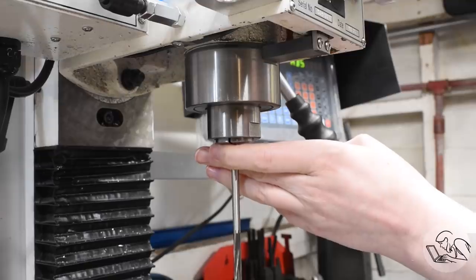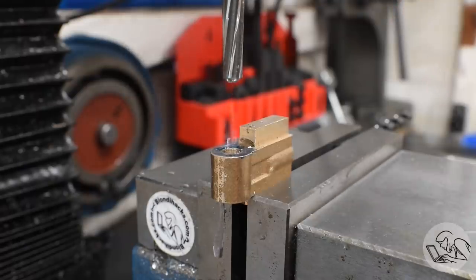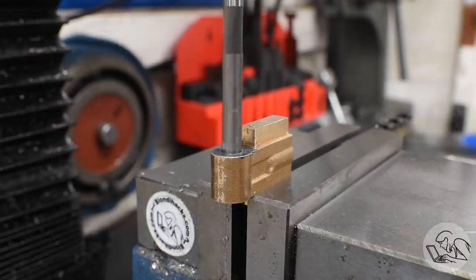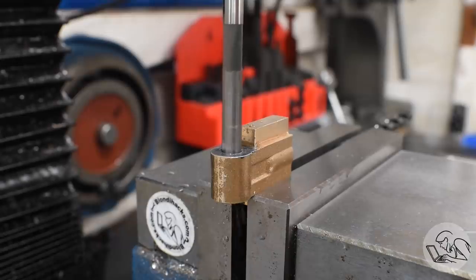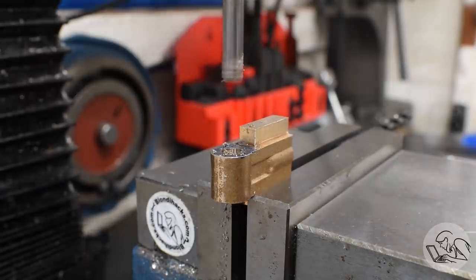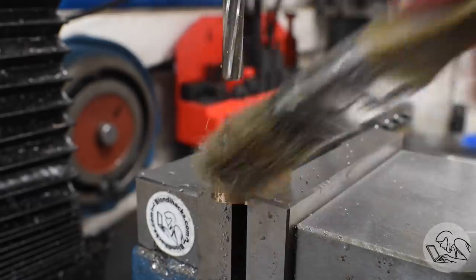Since doing this I've actually learned that there are short reamers you can buy - the magic phrase is 'drill length reamers,' so if you search for those they do exist. That's a pro tip from one of my viewers. And if you're wondering why not just cut the reamers shorter - the reason is I don't want to lose the center on the back of that reamer. There's a center on both ends of reamers from how they're made, and those centers are really valuable for certain setups and if you ever want to regrind them.